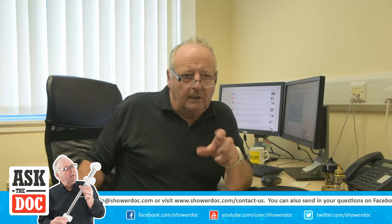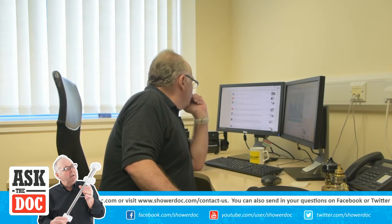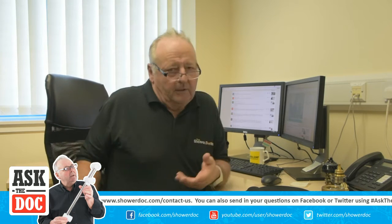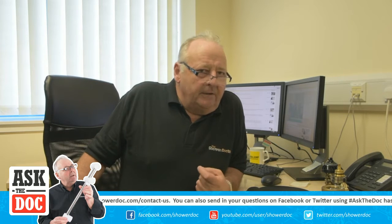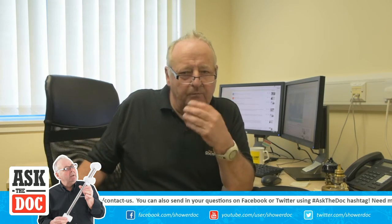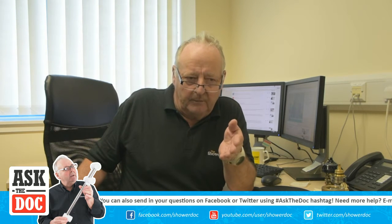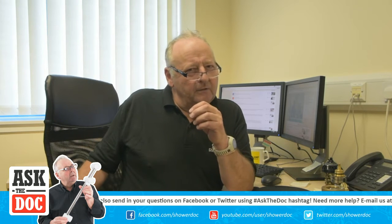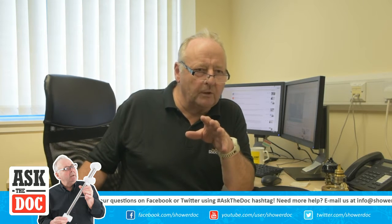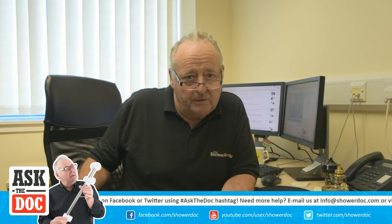That takes a huge amount of power. The standard now is an 8.5 kilowatt shower — and that's what Ice Boy has. If the shower's not heating properly, it would really only be a burnt-out element or a micro switch not allowing power through. In that case the shower would be barely lukewarm. I suspect Ice Boy's problem is simply that it's not as hot as he hoped.